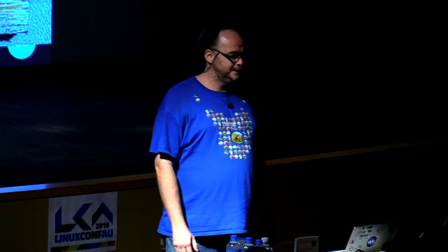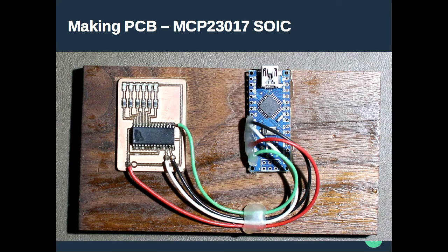Making PC boards on the 3040 can be done with a V-carve bit and the $600 machine with no spindle upgrades. That's the smallest component I can reliably do. Through-hole stuff is all fine — you can get small drill bits, 0.8 or 1mm, and make all your DIP sockets, resistor and cap holes. Vias are a problem because you're drilling through and then have to solder both sides manually. SOIC chips like the MCP23017 — an I2C 16-port GPIO expander — have a pin spacing of about 1.27mm, which is achievable.